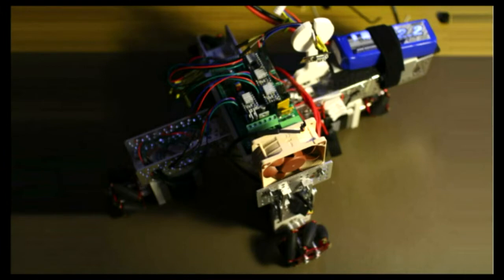I decided that Omniwheels are great and built an Omniwheel-based robot. My decision to use stepper motors to run the four wheels was apparently not so great. I thought it would be good because I wouldn't need wheel encoders — I could just rely on stepping. But if you're telling it to go in direct X or Y translation, it snakes pretty badly. Stepper motors make the rollers and wheels far more likely to slip, so you're playing on ice effectively. I still think I can compensate with an IMU, but it's an ongoing battle.